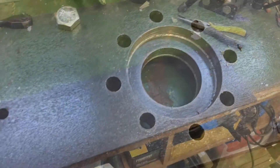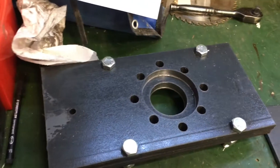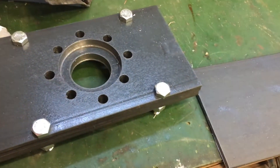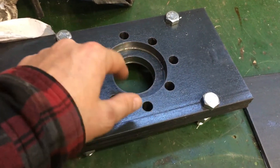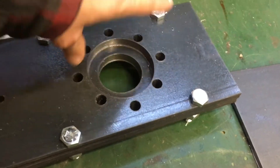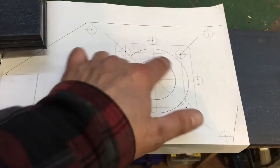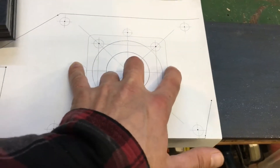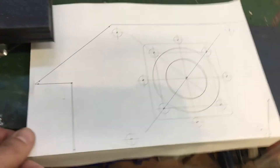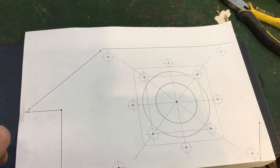This is the next part of the video. I'm going to basically do the same thing that I did for the motor mounts. Those are an SAE-A size mounting hole, so that's three and a quarter inch with the appropriate bolt hole centers. I'm just going to use the same template to lay out the center and drill the three and a quarter inch hole, plus the same mounting bolt holes. We're going to do one for the left pump and one for the right pump.